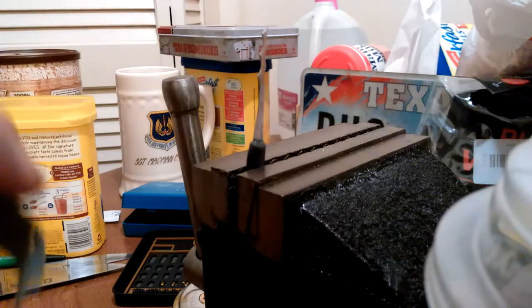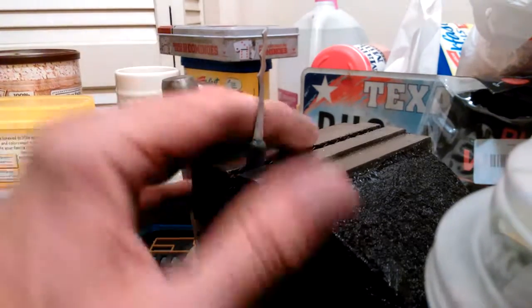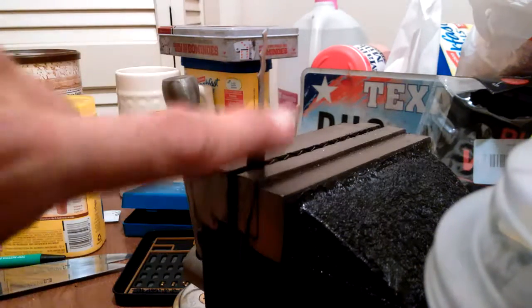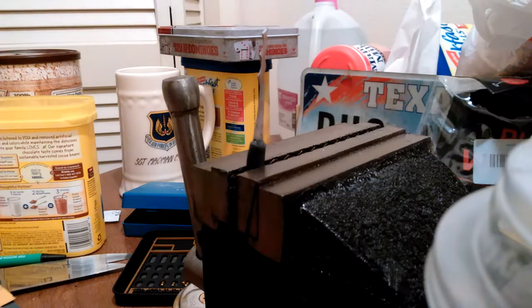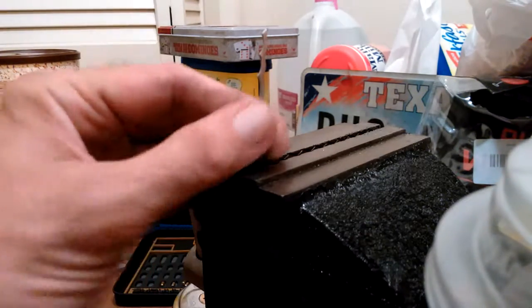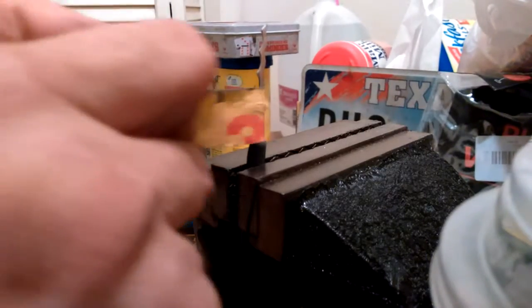So you can cut off a piece of, what I actually started with was a piece of 400 grit sandpaper cloth, because the gouges were so bad in this, and I went back and forth like this on it with the cloth, and got quite a few of them. I was trying to also round off the edges. You want to bevel the edges over here on the sides a little bit, and this is where a bench vise comes in handy when you go to bevel your edges, because you just put a little piece right here.